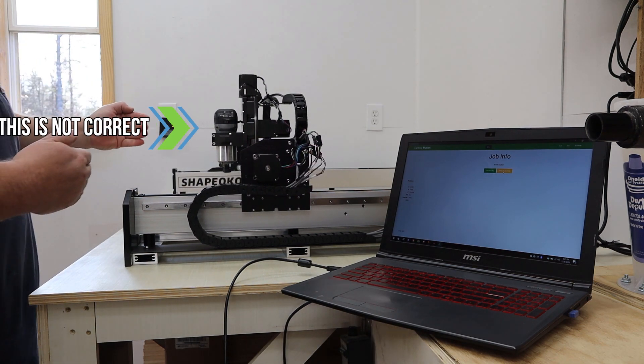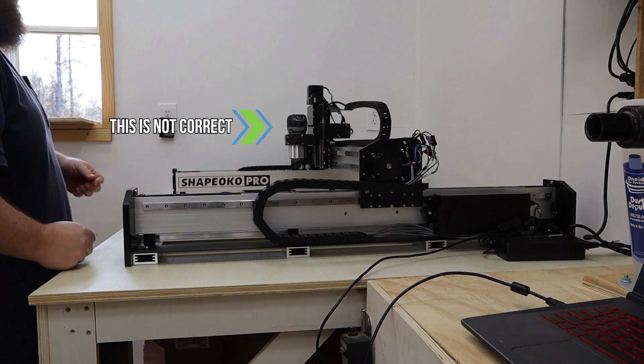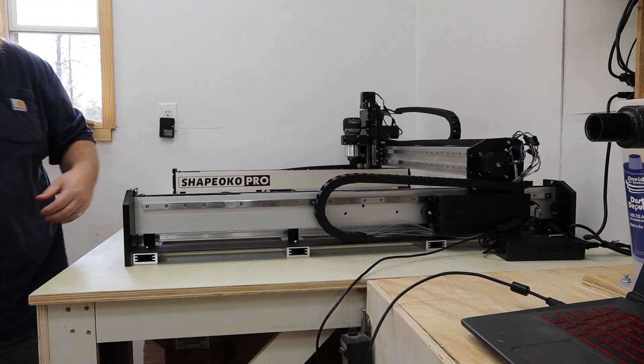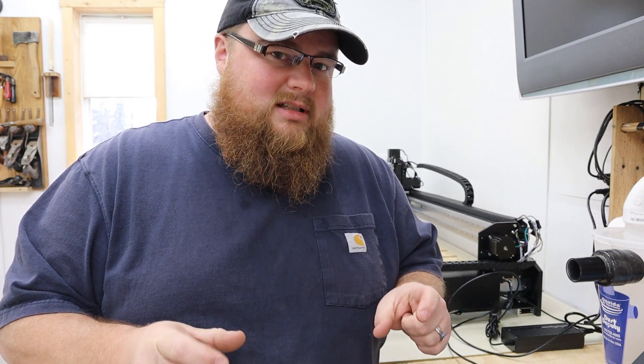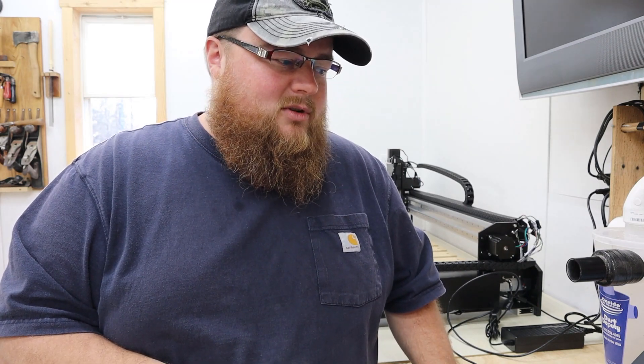This one homed. Now it's moving back the X and Y axis to home the rest of the machine. Looks like X will be first — and X is grinding out. I looked in Carbide Motion and realized I forgot to set another parameter. When you connect to the machine and go to Settings, you have the travel dimensions where you click Load Defaults and choose Shapeoko Pro. I forgot to also scroll down under the GRBL settings and click on the configuration data point and choose Shapeoko Pro there as well. So I just did that and set the configuration data, then clicked OK to save.